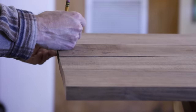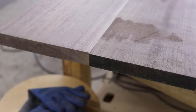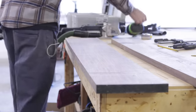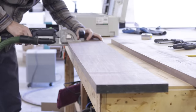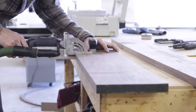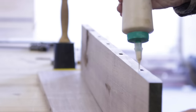I'm done milling the boards for the tabletop at this point and it's time to start the glue-up, which I did in two halves. The lumber I was able to get was pretty wonky. The boards were pretty bowed all over the place, and since they were surfaced four-quarter lumber, if I had jointed and planed them I would have been left with a super thin top. So instead I went a little extra with the dominoes, then ran each half of the top through my drum sander.